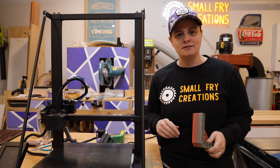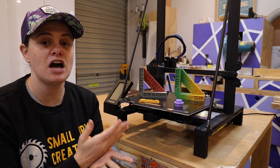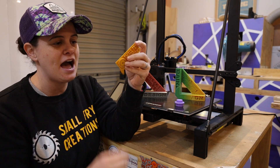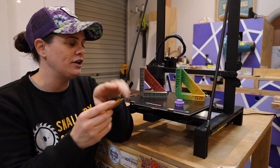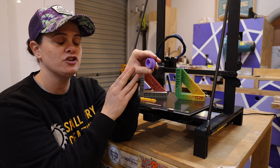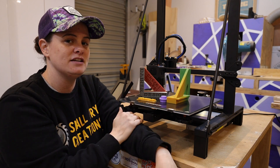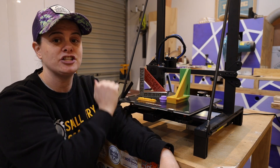When it comes to build adhesion, you don't always need to turn it on — it really comes down to the design and how much surface area is on the build plate. When I was printing my logo, it was my first print so I automatically had build adhesion on; turns out I didn't actually need it because the bottom of the design had enough area to hold it on the bed. When it comes to something like the Lego stud, because the bottom isn't a huge surface area, you do want to have build adhesion on to make sure the build stays on the plate throughout printing. With the squares, it's quite a lot of surface area so I didn't need it. Whether you do or don't will come down to how much surface area is actually touching the build plate.